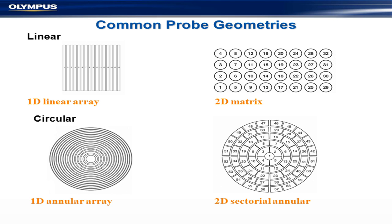Linear arrays can only steer and sweep in one plane, but that tends to be enough, because once you put it on a scanning jig and motorize it, you've got a fully automated system. If you want something fancier, you can try matrix arrays — these get very fancy, they're usually custom-built, and they cost accordingly; they come off the shelf from us, but custom ones take maybe 10–12 weeks. There are also special arrays in other geometries, which generally take a long time and are expensive.